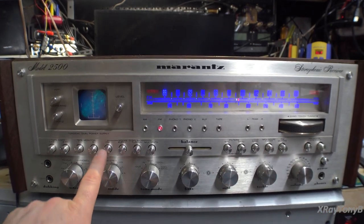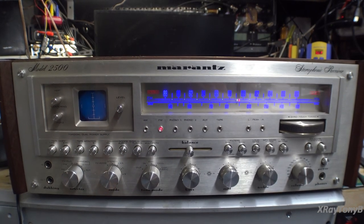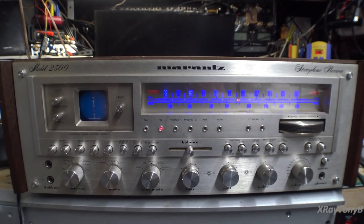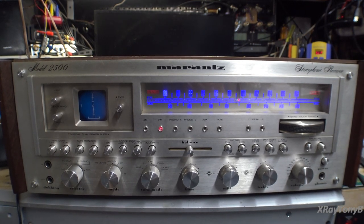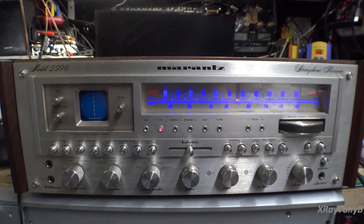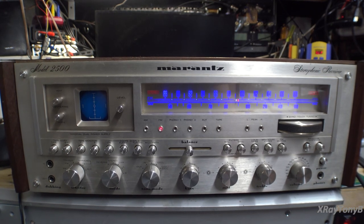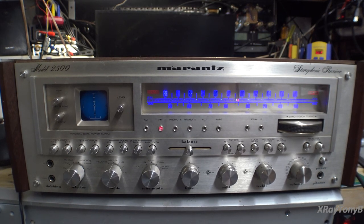The thing you need to remember about this oscilloscope is when you shut it off, it is not really off. It does cut the high voltage to the tube, but the filaments are still on. You have to remember that whenever this receiver is turned on, the filament of that tube is on. Because the filaments are raised to 575 volts, it's not really easy to put a relay in there to kill the filaments — although it could be done, it would be a lot of work to design something to do that safely and properly. That being said, that scope should last a very, very long time in there.